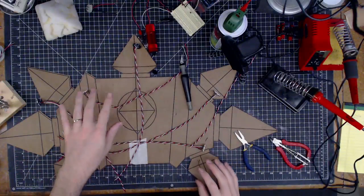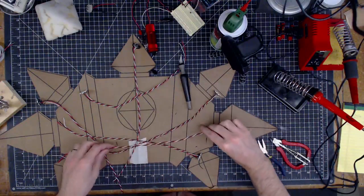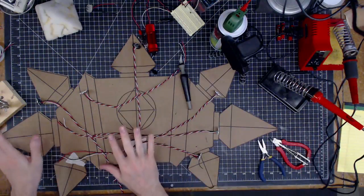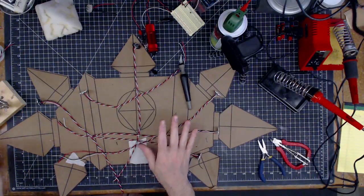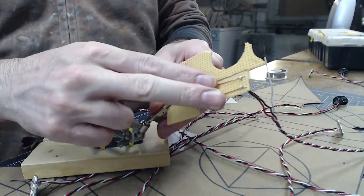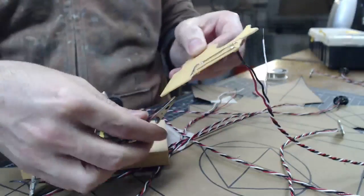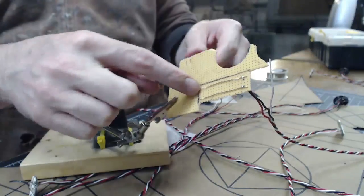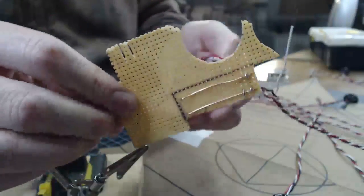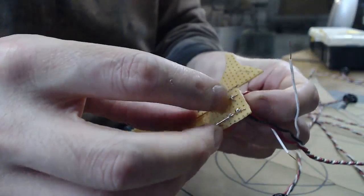The setup that we have here, other than our electronics, is just wiring all of these NeoPixel Jewel lights - they're each going to go to one of these spikes. I've sort of loosely laid them out. The main thing I need to do is connect the power of all of these together so they can all get fed into our power source. I've got my little helping hands here, and I've got a couple of wires run through here. I'm going to solder all of my lights to this so they will all run off of the power - poke them through the back, and then solder them to these wires so they'll all be run in parallel. Then this will go over to my power source. I'll flip this over and fold the wires down and solder them with their buddies.